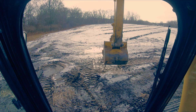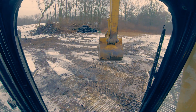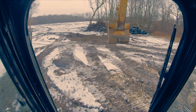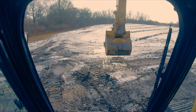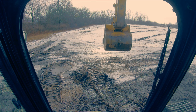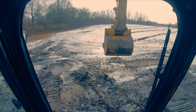That's the most common use of flipping the bucket around backwards. Another use I've seen a lot of guys use is for pipe work in a trench where you could only access it from one side and you wanted to sprinkle material. You'd grab some material out of your stockpile, bring it back over the hole, and as your guys needed it - if there was a building, wall, or structure that prevented you from getting your bucket way out over the trench - you can still dump your material in the hole from this side with the front bucket configuration without going over to the other side of the trench.